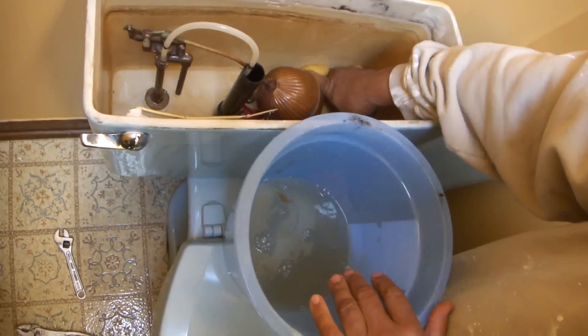I'm going to buy an economy toilet seat also — look at this, it's only $5.54. Can't go wrong. Always try to look for a product that has not been opened, because you don't want to get home and find no nuts and bolts in it. Last thing I need over here is, if you remember, the supply line, and then I need a wax ring — I'm getting the kind that has the bolts already in it. And there are different types of caulk; I'm just buying a small one. I'm going to caulk the bottom of the toilet with that. Make sure it says white on it if that's what you're looking for.